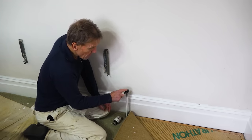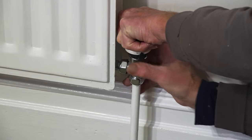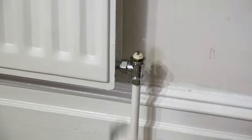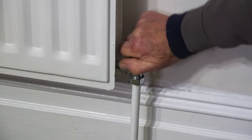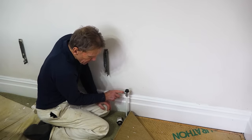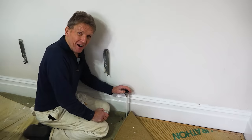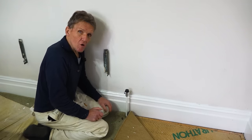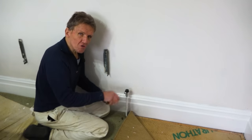What you've got to do is take this off. When you get thermostatic radiator valves, you get one of these little service caps inside, which is a plastic cap. What you do before you drain the radiator down is take this off, screw the little cap on, and that will manually close that valve right down so there's no problem. If you haven't got one of these caps, you can fit a cap on the end of the radiator valve itself to plug those off. But by far the best thing to do is get yourself a service cap and keep it somewhere — I tend to put them just behind the radiator. Most of them are the same fitting, so one cap will do for all the radiators in the house.